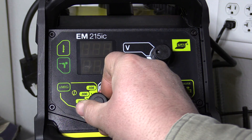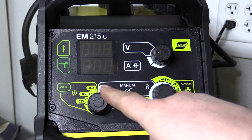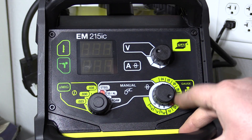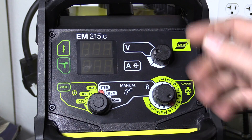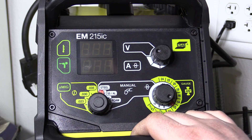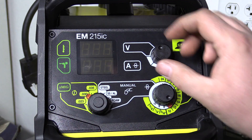You also have a manual mode here. If you turn this knob over to any of the manual settings, you have normal control of the wire feed speed, and then the voltage knob controls your voltage. When you're in any of the S-MIG modes, the voltage knob doesn't do anything at all — the voltage display even goes blank when you're not welding, because the only thing you're setting is the thickness. And even though it doesn't have the color display, it still does have a digital display for voltage and wire feed speed. Most other MIG welders in this price and size category don't have that, so that's one feature this has over some of the competition. The knobs have a good feel — they feel solid and smooth and adjust nicely.